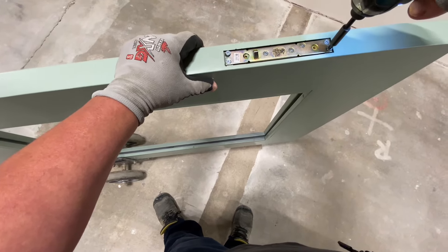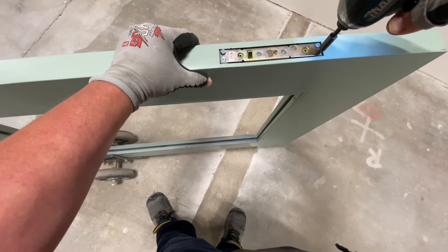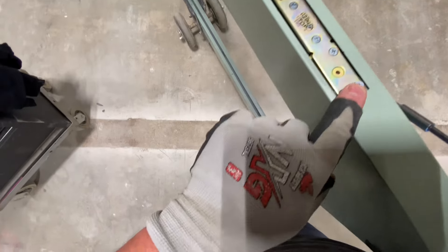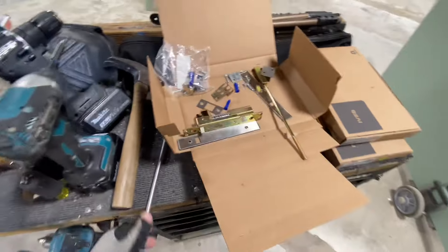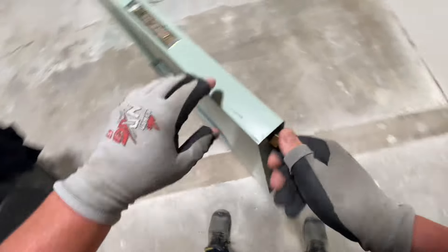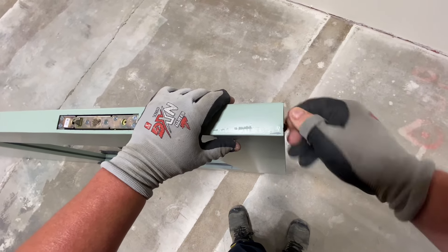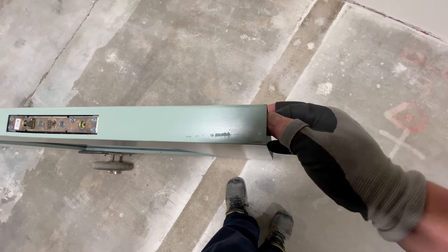As far as the length of your rod at the top, you don't want the top one sticking out above the door at all - that could cause problems like the door closing and then not being able to open again. Seen it, done it, don't do it. The top flush bolt should just be flush with the top of the door, or even a little under. In a perfect world you're going to have an eighth-inch gap at the head of your door, so as soon as that bolt moves up more than an eighth of an inch it's going to go into the strike prep of the frame. It just needs to be flush with the top of the door.